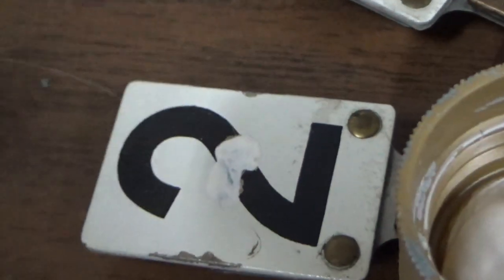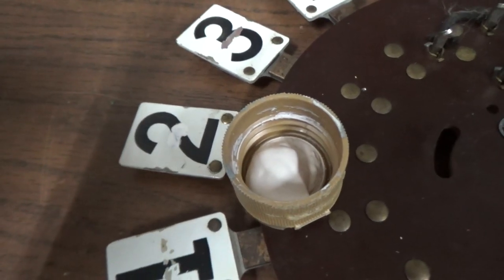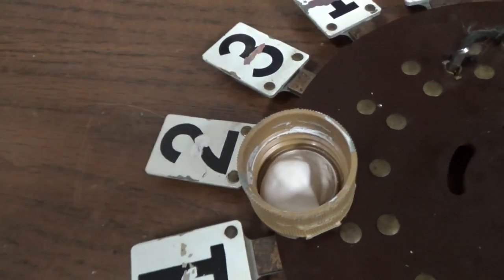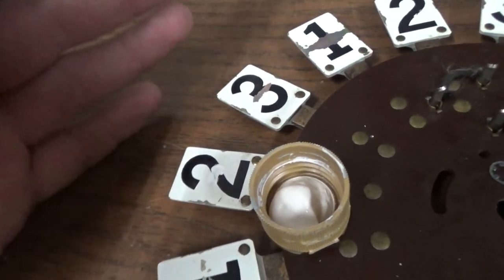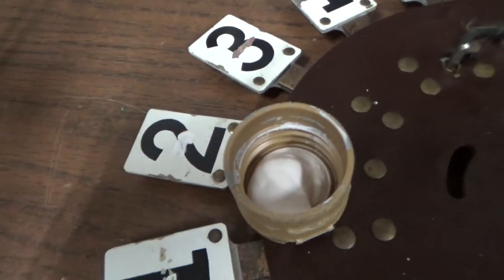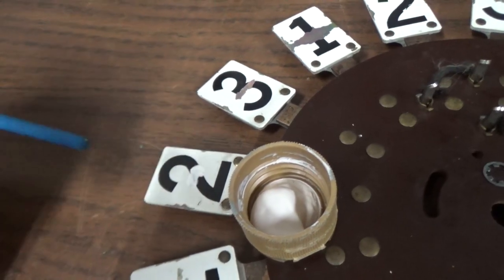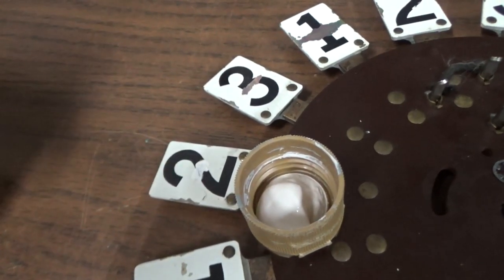So I'm going to attempt to put the smallest little dab of something green in there to maybe green it up just slightly. But whenever you're mixing white, it's so hard to do because just a little tiny bit of any kind of other pigment will really skew it one way or the other. So it literally might be you take the end of the paint stick and touch the green paint with it, and then mix it into the white paint. You don't want much.